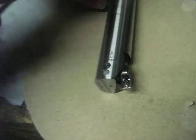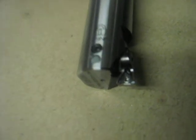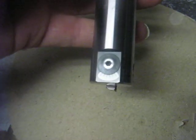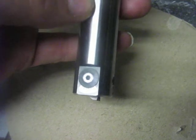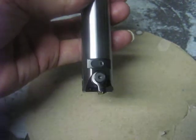Kind of a neat little thing here — hopefully you can see it. It's got a triangular carbide cutter and it's indexable out in increments of approximately ten thousandths of an inch by this little dial here, so you can machine very accurate holes with it.